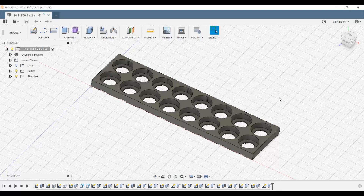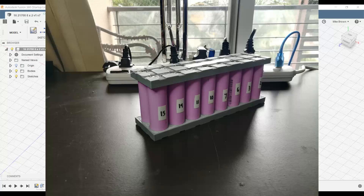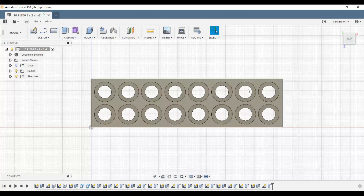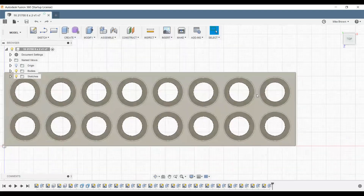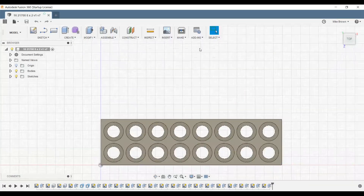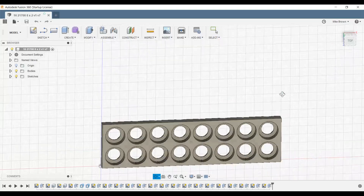This is the design for the cell holders for the 16-cell test battery that I built. What I need to do is get that set up for 20 cells, because we're going for an 84-volt pack — 84 volts fully charged. I need to add two more cell holes to the outside while maintaining the inter-cell gap and the extra bit on the end, which is thicker than the spacing between cells. I also need to stack this thing three high.